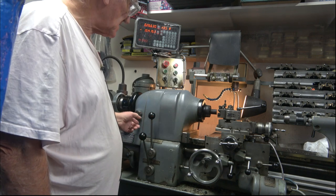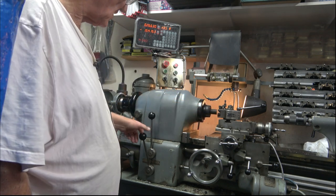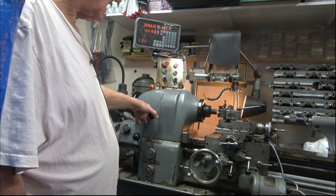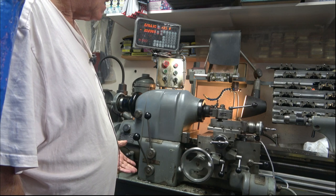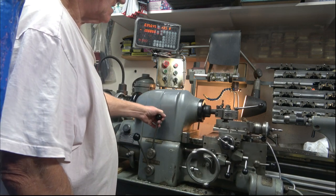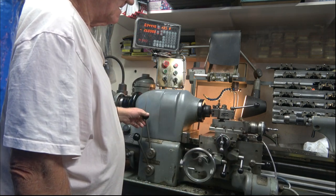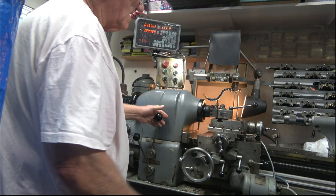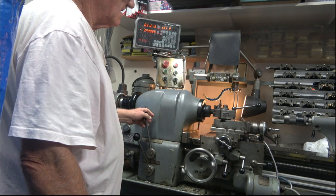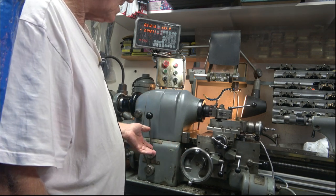So what I'll do is, say the tool is well away from the part. So I'll start it up. So when you're ready to cut, and it stops. You wind your tool away, back to the start, stop, put another cut on, out, back, another cut, until it's finished. So that's the general principle of it.